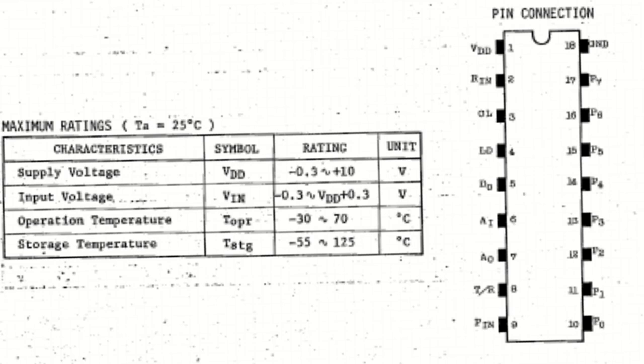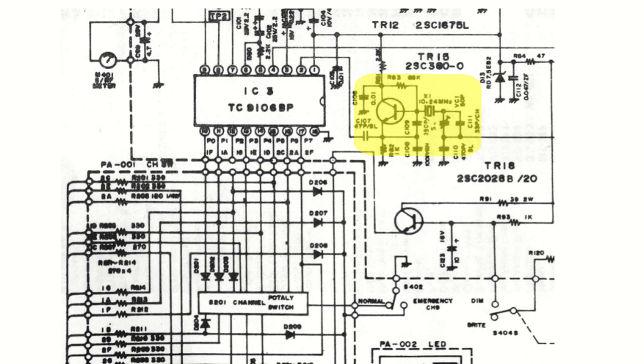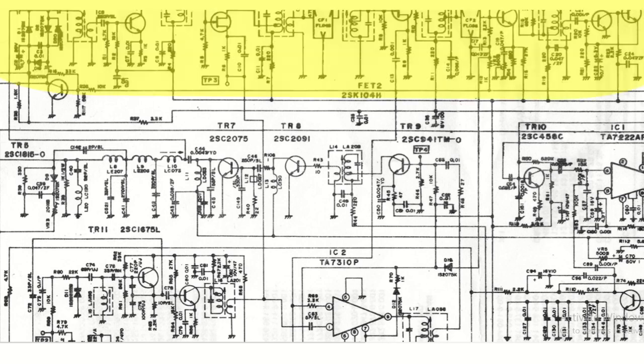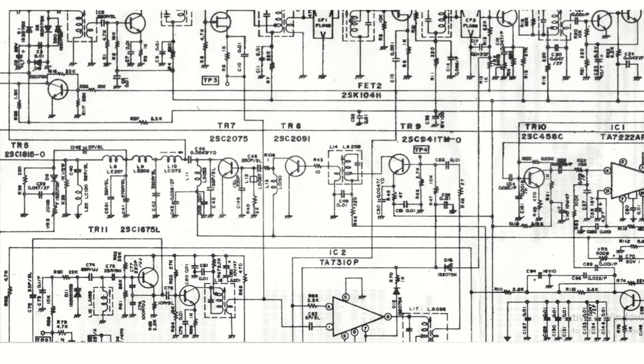The reference oscillator is also mixed with the VCO signal by the radio in the transmit and receive mixing circuits. This is the reference oscillator in the schematic. This is the VCO in the schematic. This is the transmit mixer chip, which performs direct mixing for the transmit carrier. This section is the receive circuit, which mixes down to the 455 kHz intermediate frequency indirectly in stages.